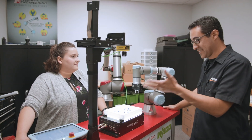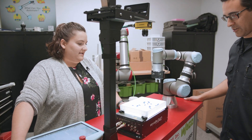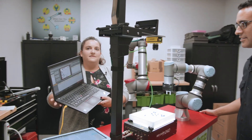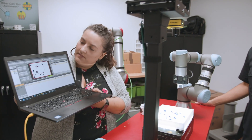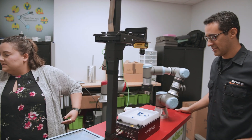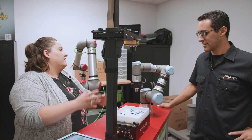The light's on — that means it's ready to go. It took a picture with the light on and found the part within the search area. If it doesn't find the part, that's when it goes and shakes until it finds one in the right area — roughly the center of the tray. Within the Cognex camera you can set the border you want to pick from — that little red box you see here. It will shake until it finds a good candidate to pick up. Some were touching each other and it rejects that. You can teach the tolerance values: if a part is rotated and you don't want it rotated, you can adjust those settings so it finds the part exactly where you want it.